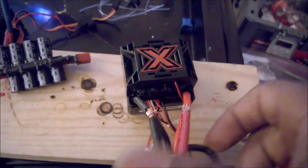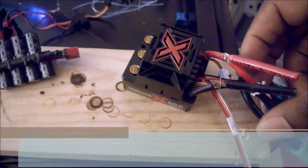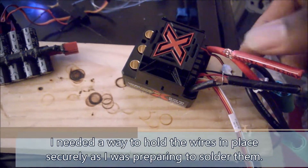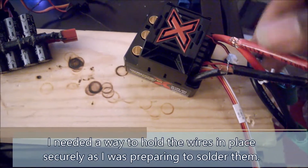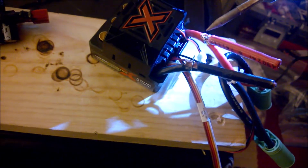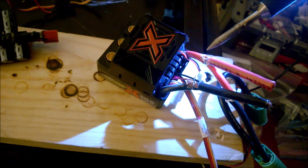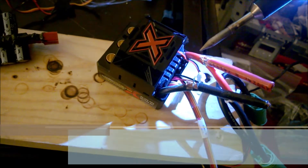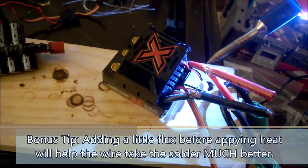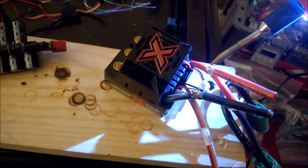As far as wiring these up, you can see I've actually stripped off a little bit of wire lead from the ESC. I took a bread tie, stripped off the little plastic insulation, and just used my needle-nose pliers to wrap these things around together — just to hold the wires in place. Now I'm going to go back with my soldering iron. Remember when you're soldering, you want to heat the wire, not put the solder to the tip of the iron, because then you won't get a good solder joint. Heat up the wire, get it nice and hot, feed the solder onto the wire, and when the solder melts you know you're getting a good connection.